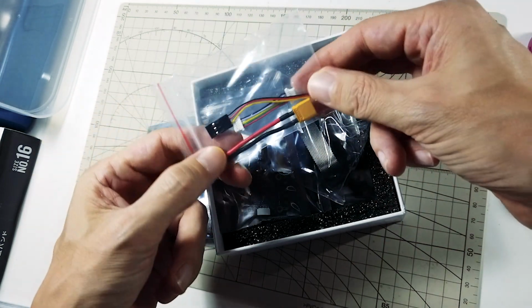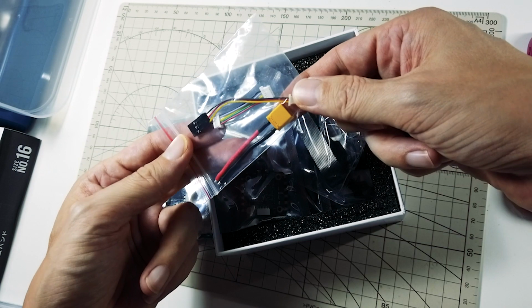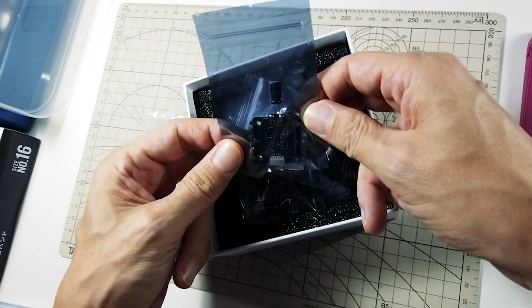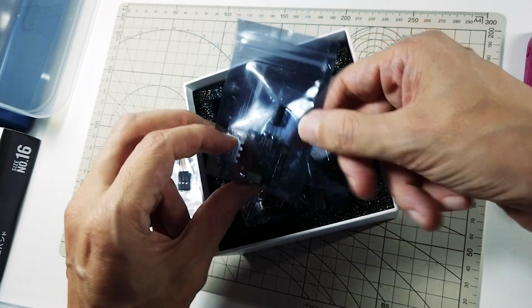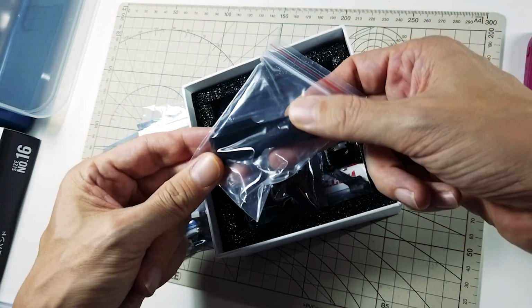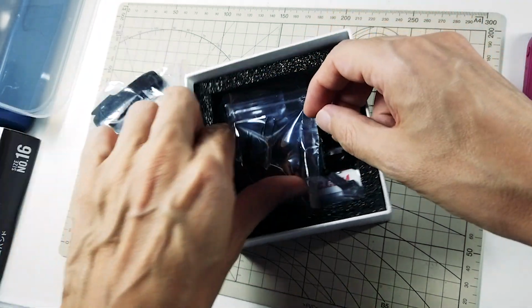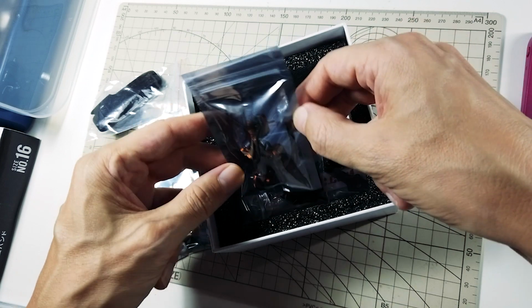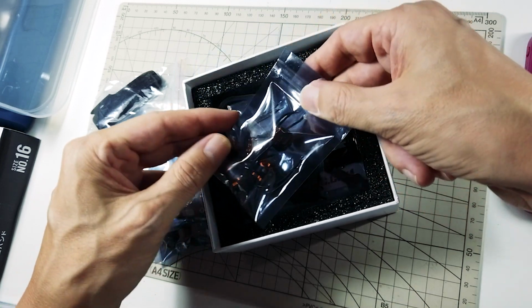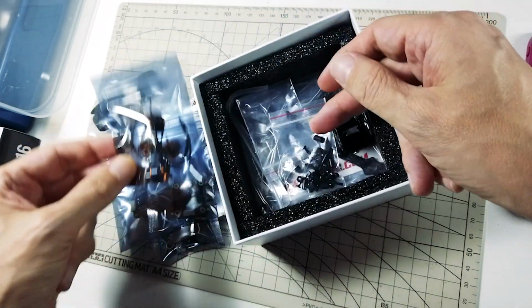It's XT30, and it looks like the plug for the flight controller and ESC, and then maybe a receiver plug. And here's the ESC. It's a 20 amp 4-in-1 right here. It's got a cap already on. I think all this stuff is 20 by 20. It's like a very cheap Velcro strap. Doesn't look like it's rubberized, so that might not be so good. And over the motors, it's the 1104 8600 kV orange motors. Seems like a bit much for these little props, but we'll see.